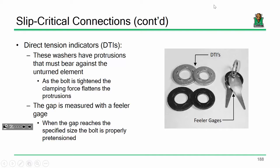You're exactly right. We're actually going to talk about that here in a little bit. But the inconsistencies actually work more in our favor than they do against us. More often than not, what you find in the field is the amount of torque that we rely on versus the amount of torque we actually get. We actually get a whole lot more, so much more that the amount of torque that we rely on, we bump it up 13%, because statistically, people tend to wrench on bolts like crazy. I guess it's just sort of common practice.